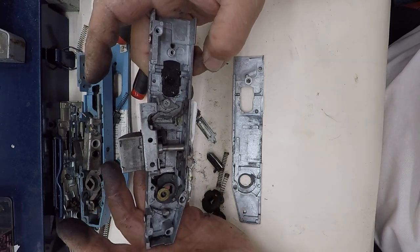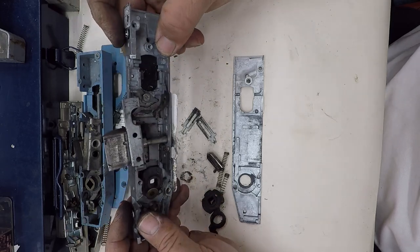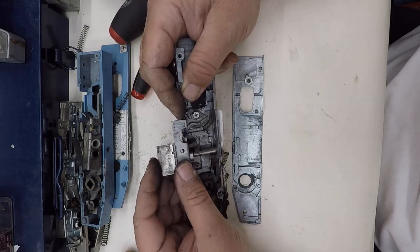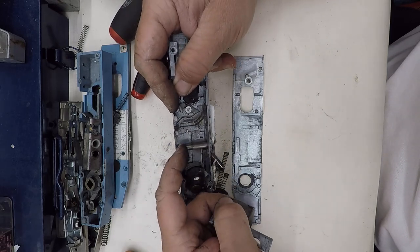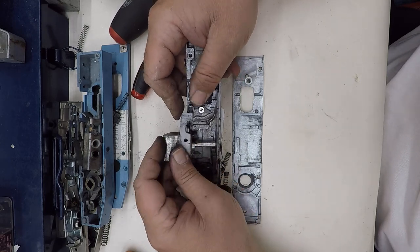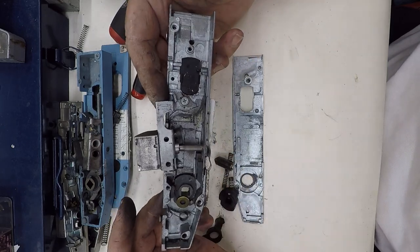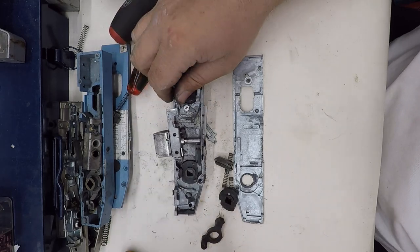Other than that, it takes a normal 570 cylinder. It is a pretty good lock — I don't get too many troubles with these locks. Every now and again you do. As for why the secondary doesn't work, I would like to have solved the mystery but I can't. Maybe it has something to do with a bit of movement in there — the bolt is very crusty to slide backwards and forwards, so obviously something's bent. How it happened, I don't know. But there we have it — Lockwood 3582, gutted, and the mystery continues. Thanks for watching.